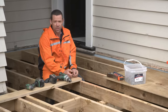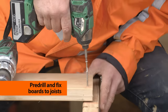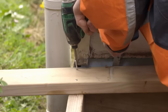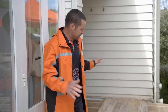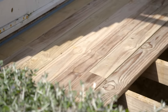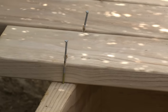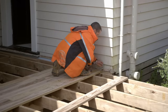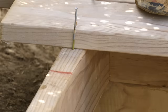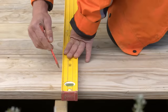I'm using a 75mm screw because my decking is 32mm thick — if I was using 20mm thick decking, I could go down to about 65mm. Fix your board down two screws per joist. I've also left my decking boards long on the edges and I'll tidy them up at the end. I've pre-cut about six lengths of board, laid it down ready to be screwed, in a nice staggered position — you don't want all your joins to fall on the same joist. Just before I screw them off, I'm going to place a nail in between each board on the ends only; this adds a 3mm gap allowing water to run through. I'm going to put a chalk line on the outside parallel with my boards, fix the outside board off nice and straight to the string line, and then all the other boards will follow suit, giving a nice even gap. To keep your liner screws nice and straight, give yourself a pencil mark to follow along the joist.